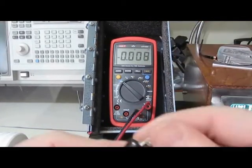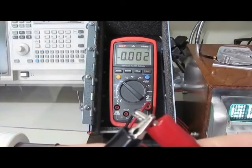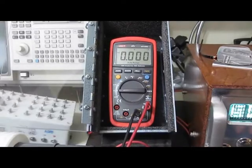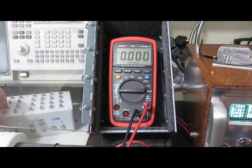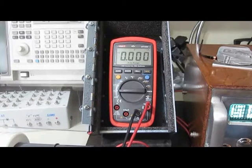And you can see here if I did short it. Yep. I suspect when the meter was tested the first time and it failed at 3.7 kV, I ran this one at 4. It survived. You know, 5's a pretty big step. I thought that it would probably take it out, so unfortunately it did.